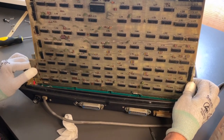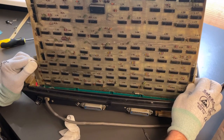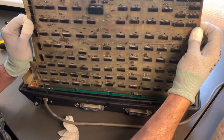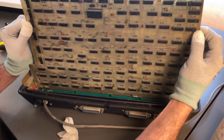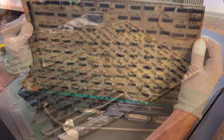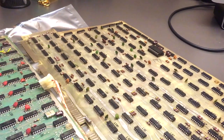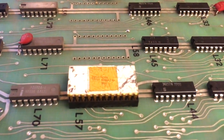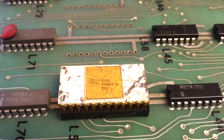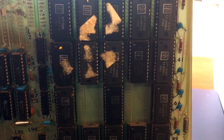It's a special card — I hope this one is intact. It's pretty hard to remove as well; everything seems stuck. Hiding behind this card is the memory card with the RAM of the system and the ROM including all the microcode. Eventually I managed to remove the CPU board, and the I/O board had already been removed earlier, finally exposing the memory board. First, a quick shot of this wonderful gold-binned ROM, part of the I/O circuit. And there it is — that's the RAM/ROM board of the Wang 2200F.